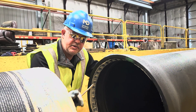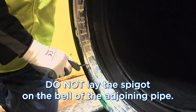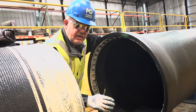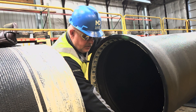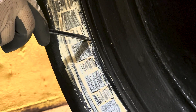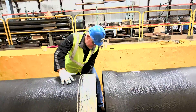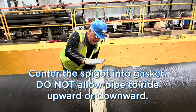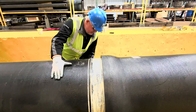The next step is to assemble the spigot with the bell. A common error contractors make is to lay the spigot on the entrance or throat of the bell. When installing restraint gaskets, it's very important to center the spigot on the rubber of the gasket. Do not allow the spigot to ride up into the bell — center the spigot with the inside bulb of the gasket. Center the pipe and the bevel of the spigot into the bulb in the center of the gasket.